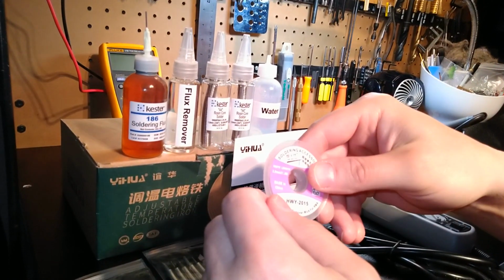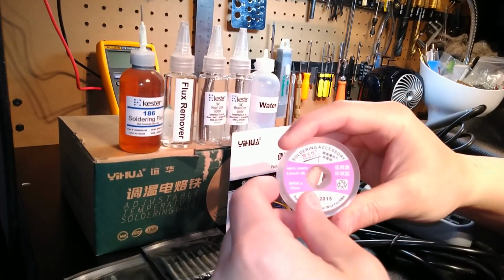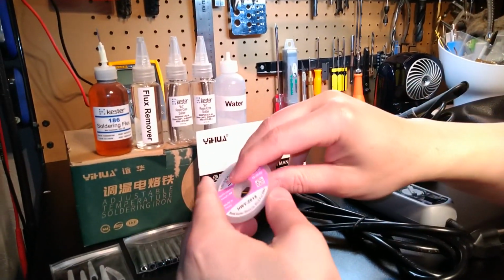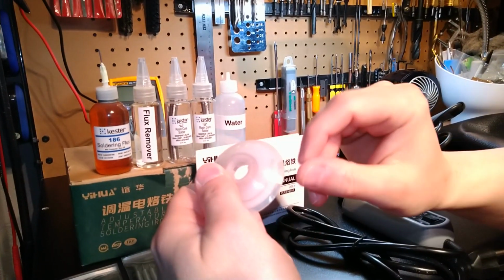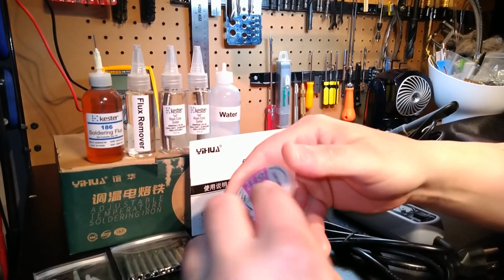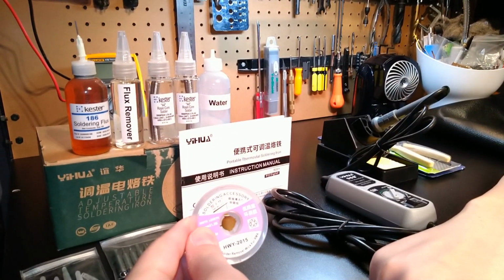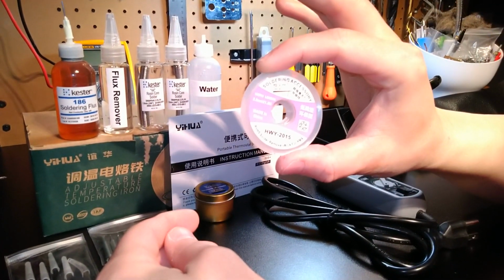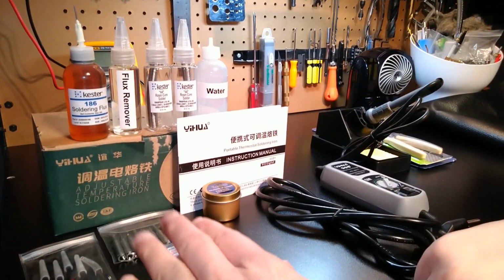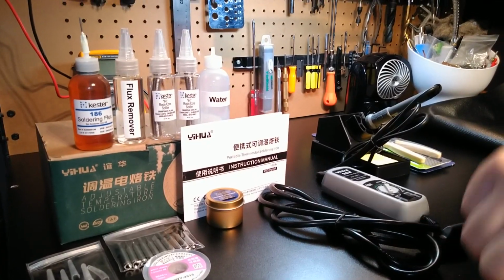Next accessory that I feel is absolutely mandatory is desoldering braid. Many of you don't even know what this is. For those of you that do, you realize how important it is to have. Desoldering braid allows you, if you do apply too much solder to a connection, this braid is actually soaked in flux, and it's just copper. It's more or less braided copper minus the tin, with flux applied to it. You simply apply this over the connection that has too much solder, heat it with the iron, and it will absorb the solder right into the braid. So again, if you do make a mistake, you're prepared because you have the desoldering braid. Okay, if you guys are doing SMD work, you know this is a requirement. Anything with surface mount where we're doing any type of rework, desoldering braid is a must. Of course, it's included with the kit.